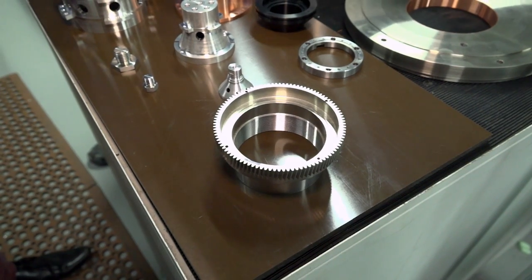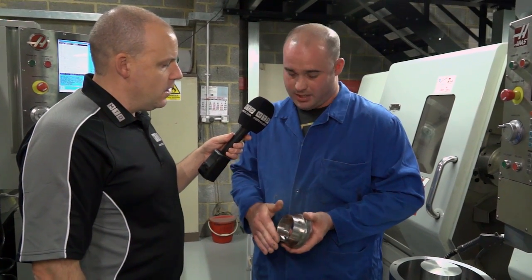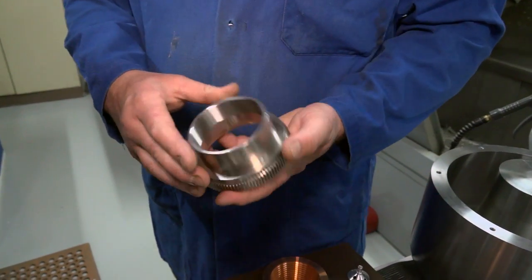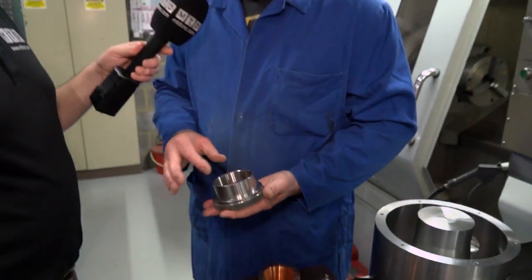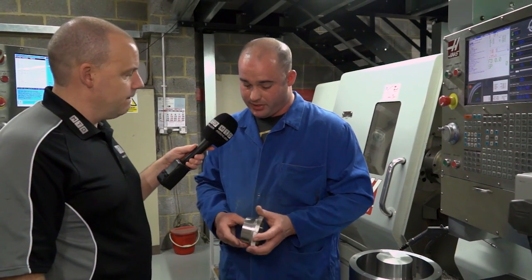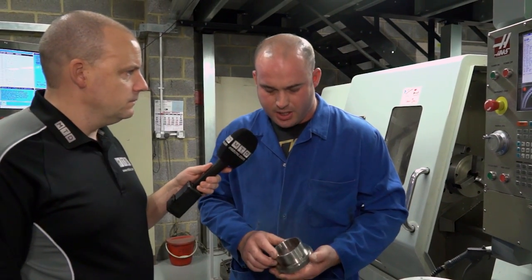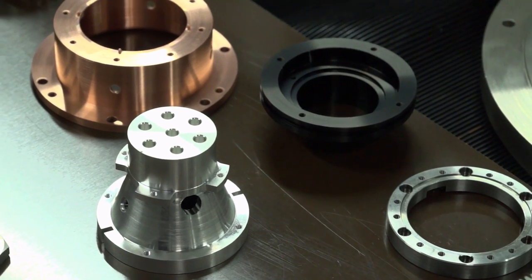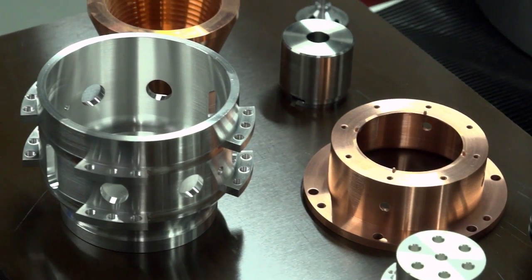And this — I'm interested in this part, Adam. What's this? This is a stainless steel part that we're making for an assembly, made from scratch out of a billet. You can't do the gearing on the outside? No, we send that away to another company for the gearing, but all the other parts we do here. How are you getting the material out of the centre? We send a big U-drill through first, then boring bars, and thread the inside of it. What sort of quantities? The last batch we made were 50 off — not massive production, but enough to need a machine with the strength to push the U-drill through.